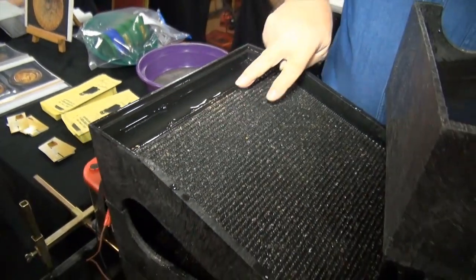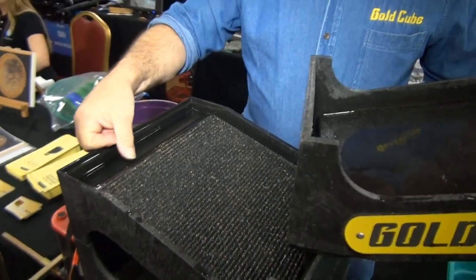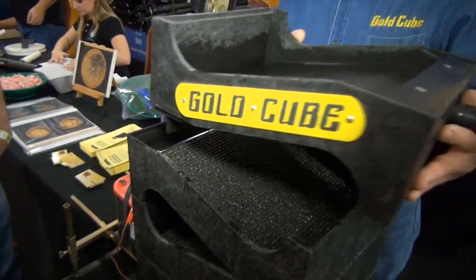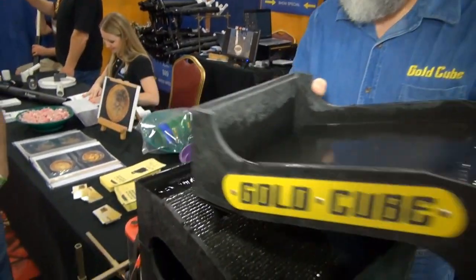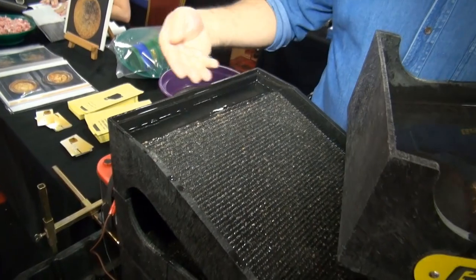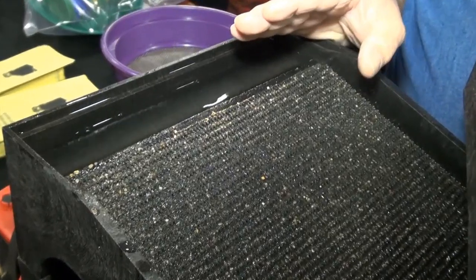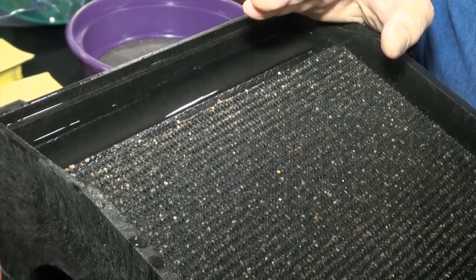See all that gold laying out into this area right here? We can also see that there's gold sitting up on that edge — it hasn't even made it to the mat yet. Now watch what happens. In a normal sluice situation, when you stop the water and turn it back on, you're going to start losing your gold — blowing the gold away. But in this situation, even if I adjust the water a little bit, all that gold is still going to be sitting there. We've made a very happy place for the gold to sit — we put it there on purpose. We don't want to leave it to chance; we want to purposely take our gold home with us.